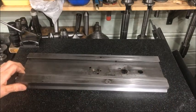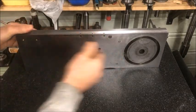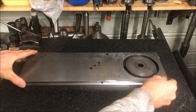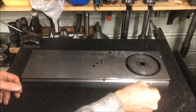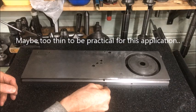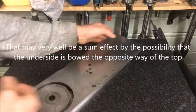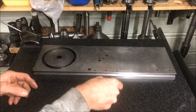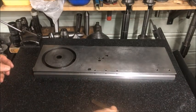As you can see it's a little bit high in the middle, but not much. Here it's the opposite — I can hardly get any shim underneath. This shim is 1/100 of a millimeter; it goes a little bit under here, but not much. It almost wants to go under, but not by much.